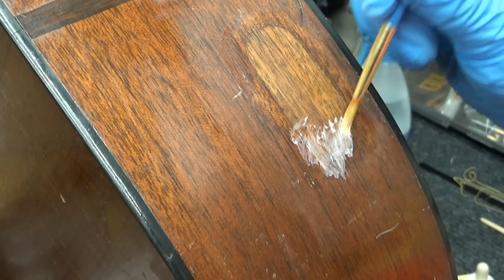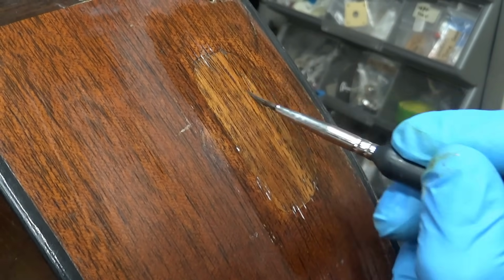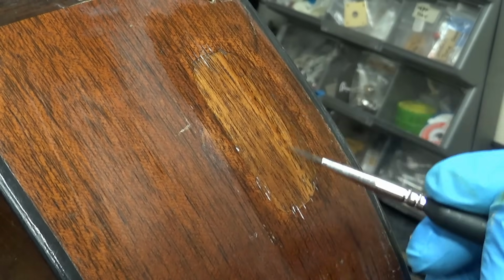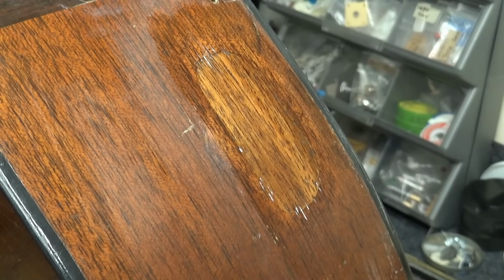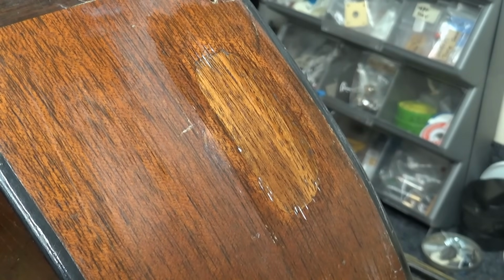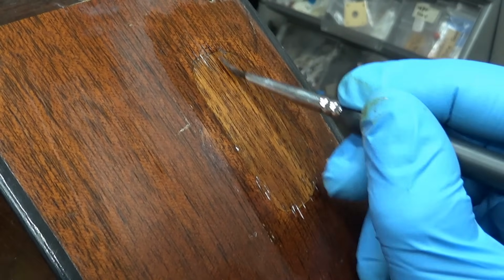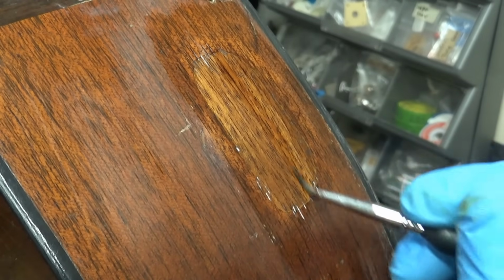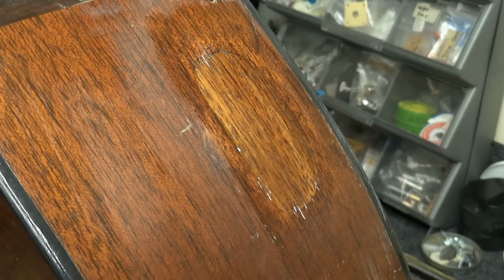This could take up a whole 30-minute episode right here. Little by little, I keep adding more color, and I'm always mixing the color, the stain, with shellac. I like to smudge it also with a gloved finger. Brush and smudge. Brush and smudge. Because with shellac the color tends to find its way always to the outside edges. So the smudging helps.